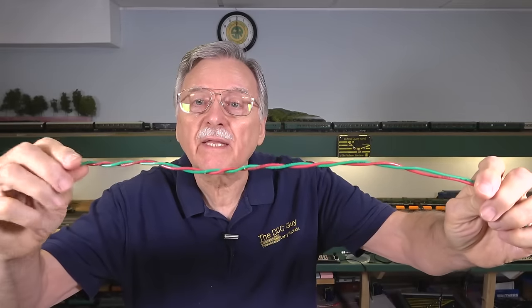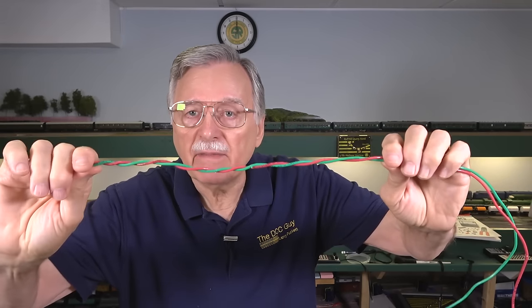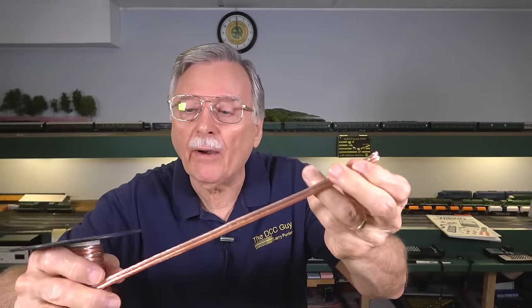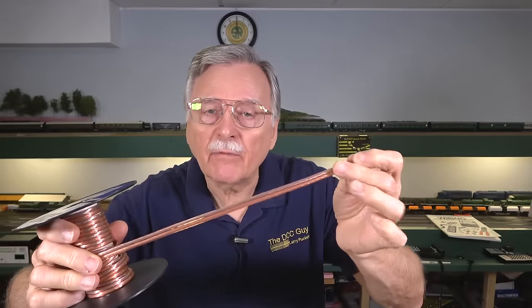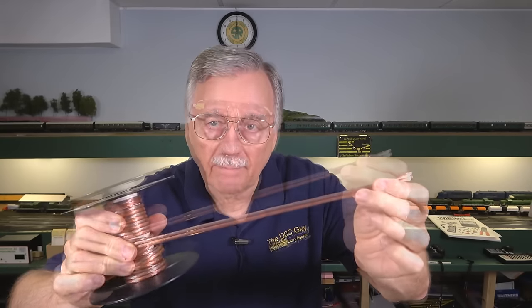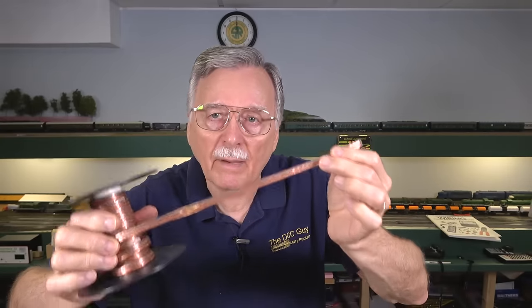One of the things you can do is twist your wires — twisting the bus wires around one another about three turns per foot. This is not fun to do and makes them difficult to work with afterwards, so I don't do this. Instead, I use what's called zip cord. This is 14 gauge stranded copper wire, and it's OFC wire — oxygen free copper. Be careful when you look for this stuff, because they also sell copper clad aluminum. Don't buy copper clad aluminum. Get the oxygen free copper. It's more expensive but it's going to mean fewer problems in the long run.